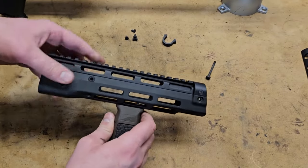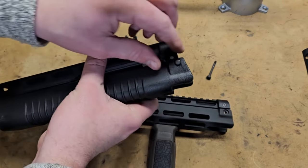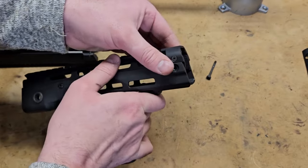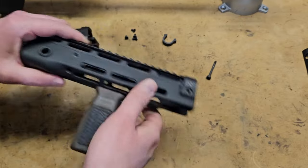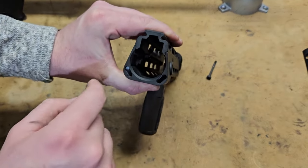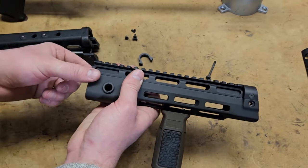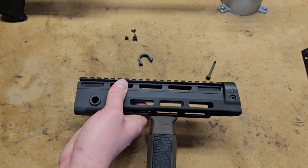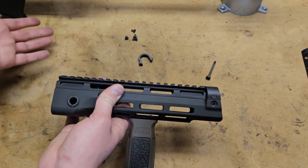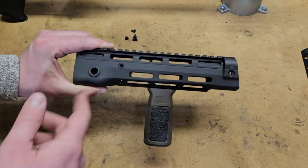This handguard has something interesting in that it doesn't tend to use the rear cup of the receiver as much, because it uses a pin at the front and then has a cup that holds the back together. Whereas this handguard has a screw at the front which takes the place of the pin, screws for the upper to attach to the lower, a barrel band that goes around the barrel to cinch the lower portion onto the barrel, and then a very tight fit with the barrel nut all the way around — it's a very, very nice fit. I talked to BAOTAC about this and they told me there's pretty much no way the bureaucracy would let any unit-level decisions be made about removing the cups off of rifles, because you might want to put the old handguards back on. So you can leave the cup on, or if you're doing a really custom build with the T91, you can take it off.